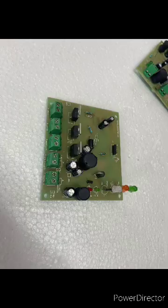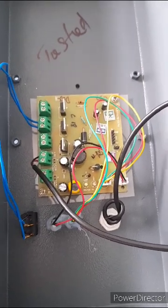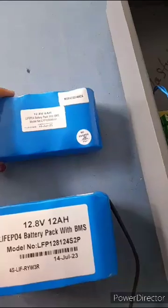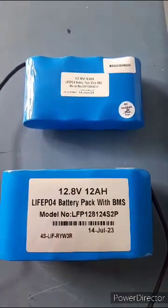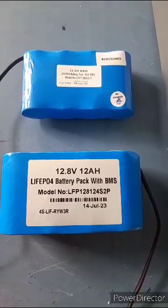With regard to the circuit, it is a microcontroller-based circuit. The main advantage is that if the battery fails, the solar voltage of 20 volts will be regulated down to 12 volts, ensuring the camera is never damaged by high voltage. We generally use a 12.8 volt 6 Ah or 12 Ah battery, and depending on the battery, we decide on either a 20 watt or 40 watt panel.